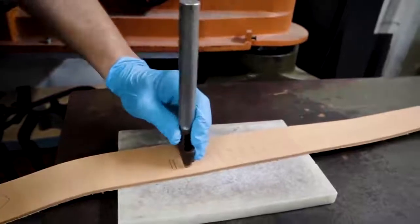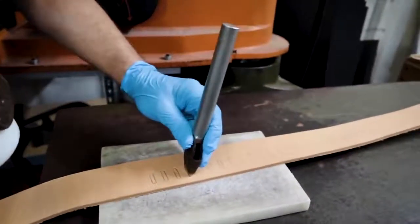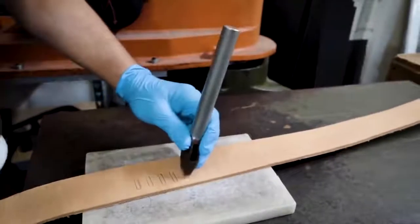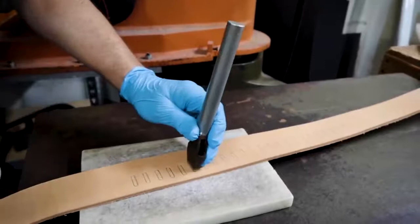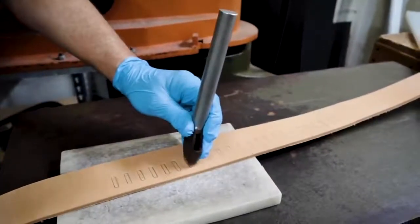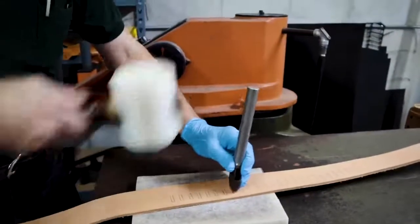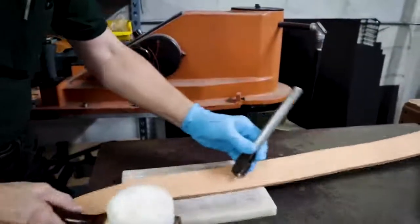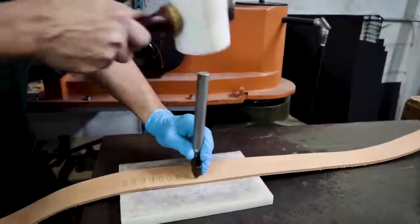To prevent accidents and bounce backs, I usually walk down the loops, putting a dent from the punch in, because when you hit hard, it tends to bounce unless you've got a really good grip on the shaft of the punch. This helps me get everything centered before I come back and smack them all the way through.